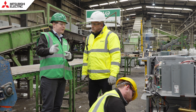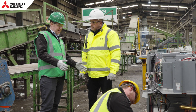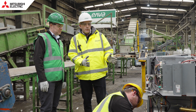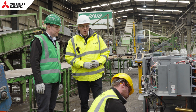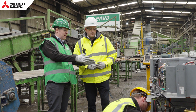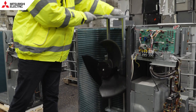So Carl, now you've removed the panels from that unit in the first stage, we're on to this next stage. So what's happening here? This comes down to the next step. In this current position, we're removing the fan. Once that's removed, it gives us more access as we move down through the further steps of processing. So the whole fan assembly — the fan blade, the fan motor, the whole mounting — that all comes out now? That's correct. It's pretty simple, just lifts off.